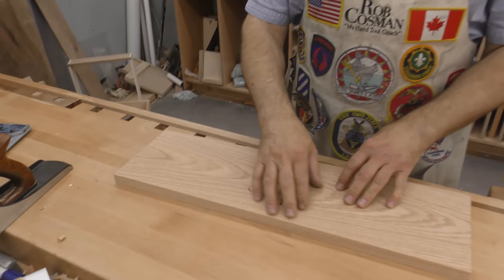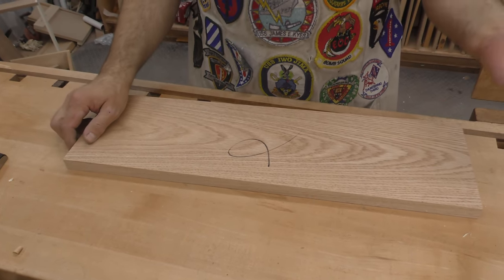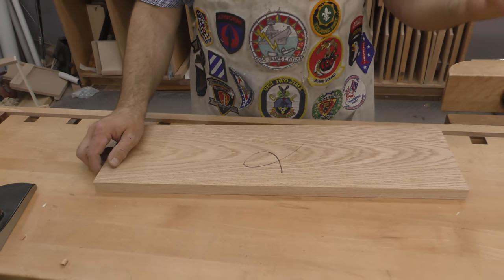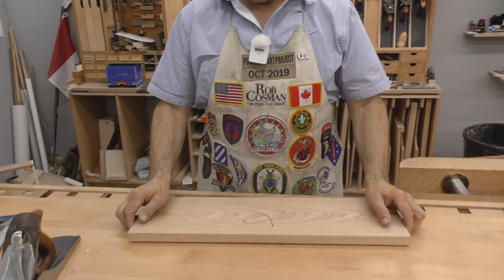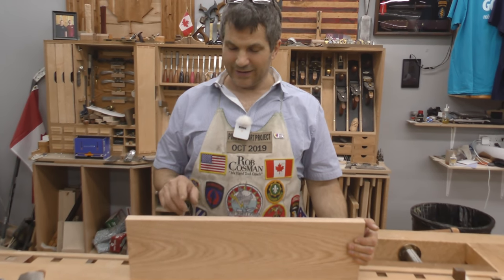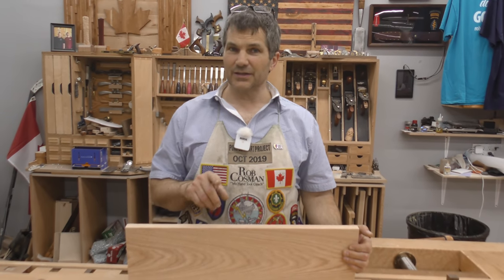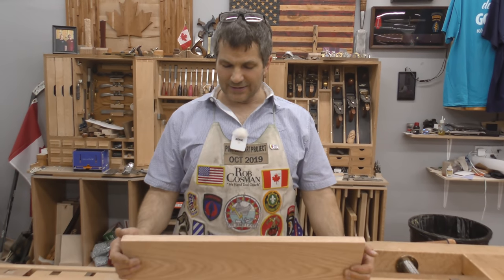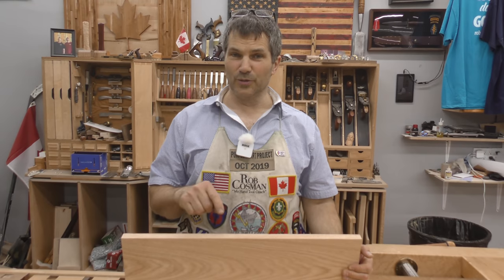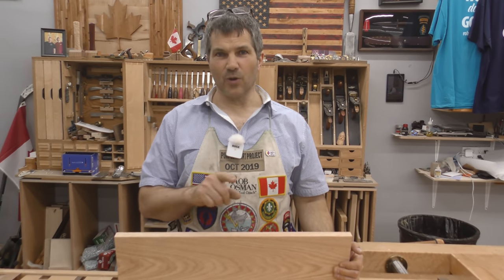In the process of squaring an edge and straightening it, there's lots of ways you could do it — you could use your power jointer, you could even use your table saw. Either way you're going to be left with mill marks on the edge. You can sand those off, but I'm going to show you that with a hand plane it's faster and actually superior. Since you're going to need the hand plane to remove the mill marks anyway, I'm going to teach you how to do the whole process just using your hand tools. So much more quiet.